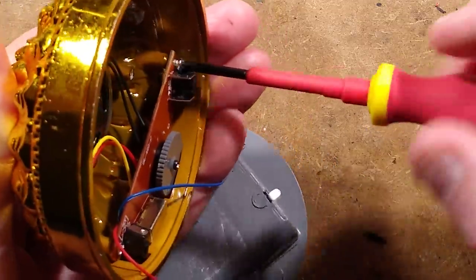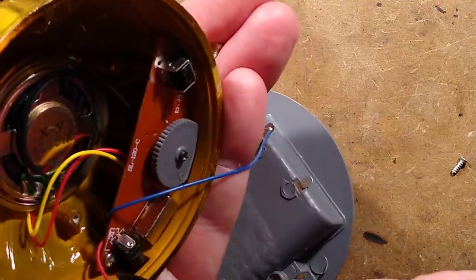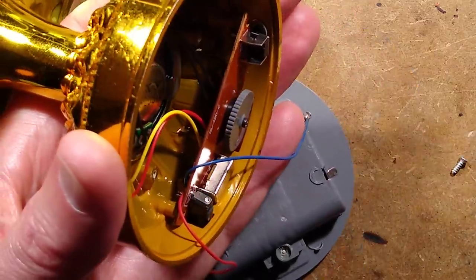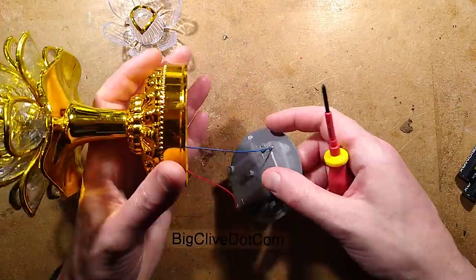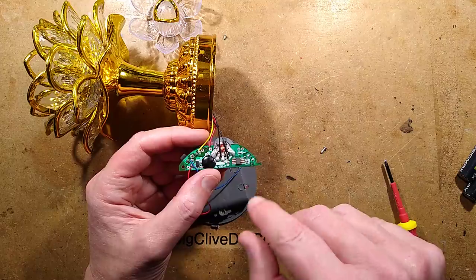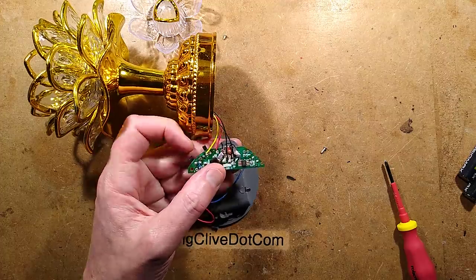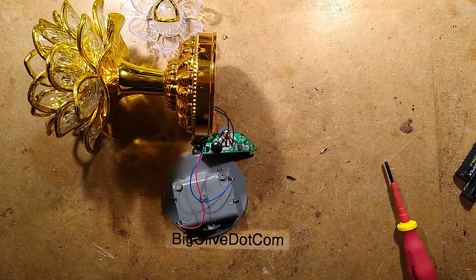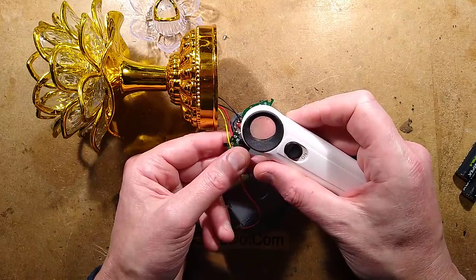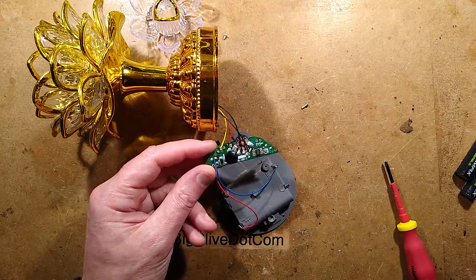Under here we have this little circuit board. Let's pop that circuit board out — there's a tiny little speaker in here marked XY, 0.5 watt, very flat, venting out these holes here. The PCB is different to what it was last time. Last time the PCB had an actual active chip in it. Is this a memory chip? Using a magnifying glass — FM25Q16A. I think that's a serial memory chip. I'm just going to take a picture of this and then we shall explore it together.